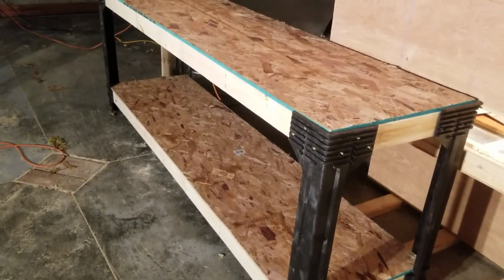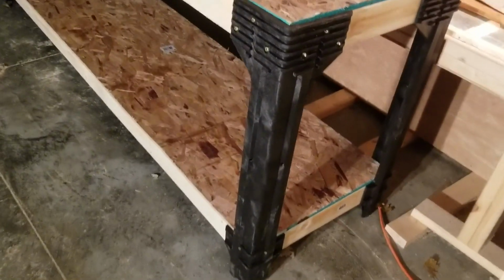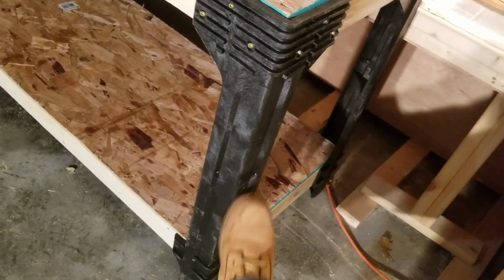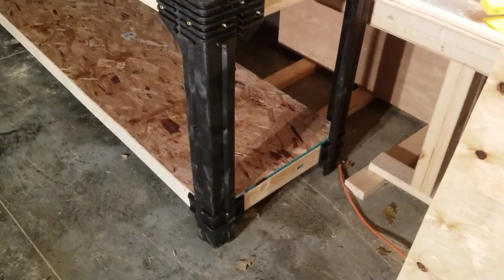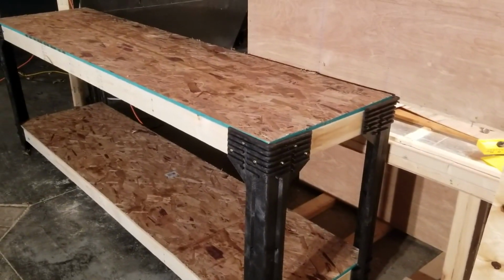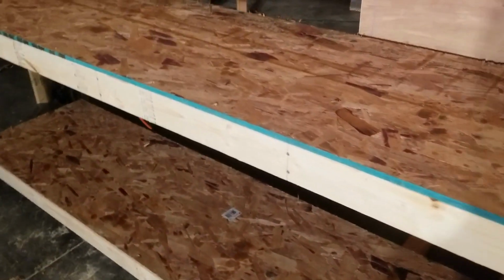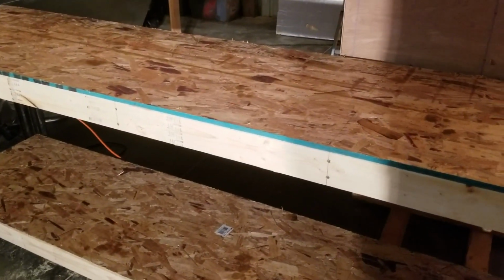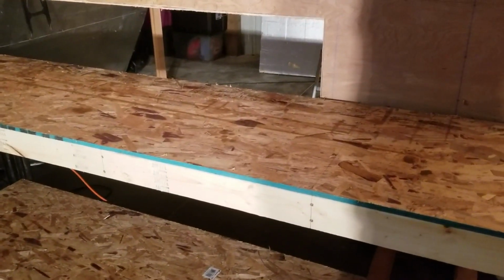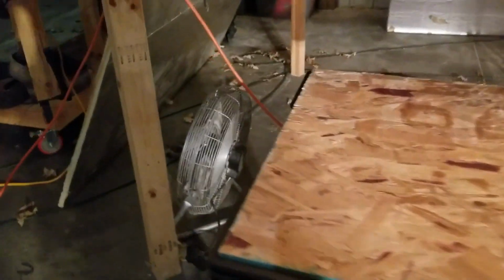It's all 2x4s, and then you can use OSB, you can use plywood for the top, and actually there's a place here for a middle shelf. The one I have, and a couple I have in storage, have middle shelves on them. But this is going to be used as scaffolding first. So I kept it 8 foot long, 2x4s, 2x4 braces in between every 2 feet. So it should be strong enough. It said 800 pounds to 1,000 pounds, so it definitely can hold up 2 people.